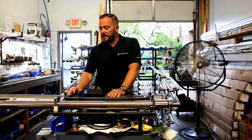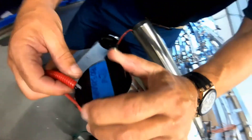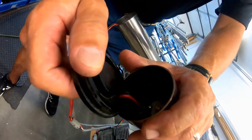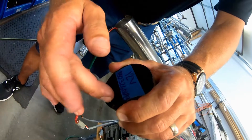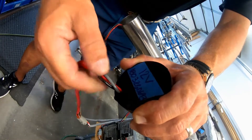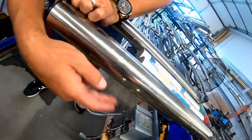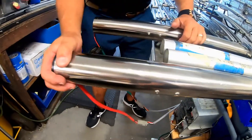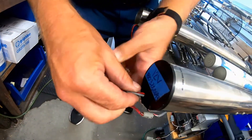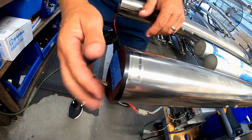What happens from time to time is, say you've got these installed externally on a hardtop. If you come around the back of here and look, there's wires that come out of this hole and there's no silicone on them. As you can imagine, if this is on top of a hardtop on the side or beneath and water gets in this wire loom and goes down in here, it runs down the casing and sits right where the flywheel is, and the flywheel will turn and spray water on it. Whenever you have any of these installed externally, you always want to take a goop of clear silicone, push the wires in, goop it up in there, then pull them out just a little bit and let it dry — it forms like a plug to make that more waterproof.